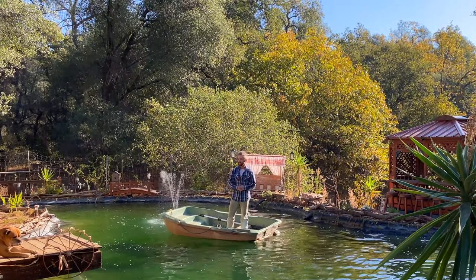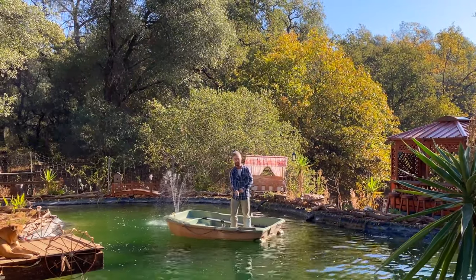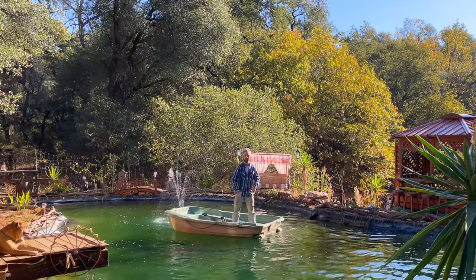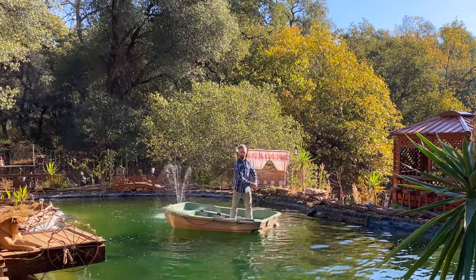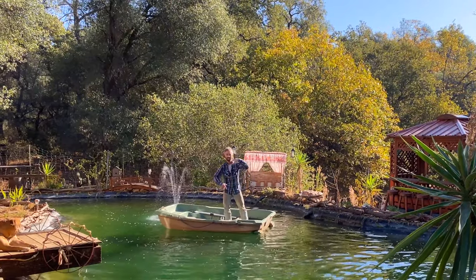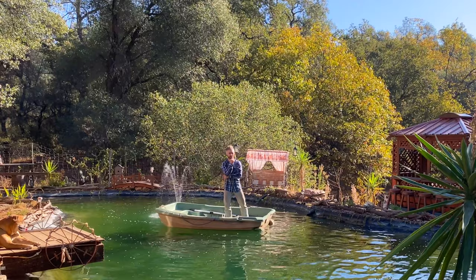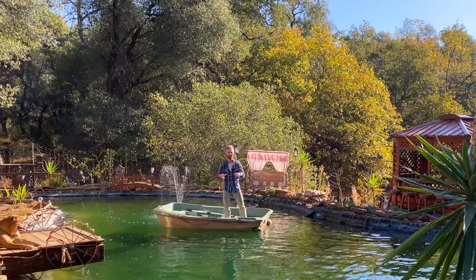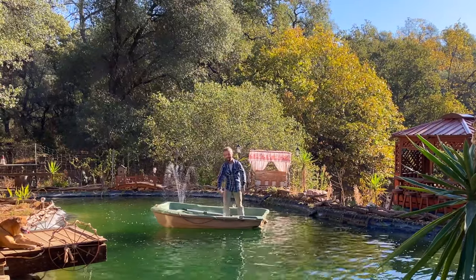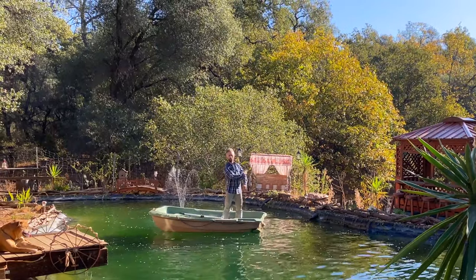And how you do that is make sure there's no rock. So literally get a rake and start raking the rocks. Any sharp edges, anything that might damage your liner. You don't wanna have sleepless nights thinking, oh, is that too sharp? Is my liner gonna rip? You just get that out, do your prep work and rake those rocks out, okay?